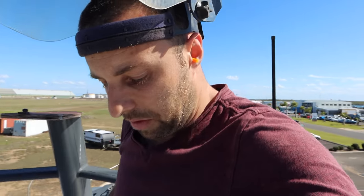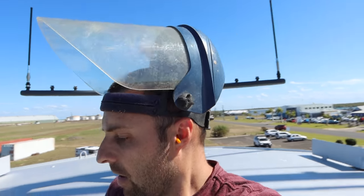Right. We're back up the top with all of the wind. We're gonna cut the slider off, move it inwards 6mm. The back one actually doesn't need to move forward and back at all. That's gonna be our point of truth. So we'll trim it off and we'll tack this in the new position.